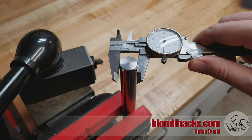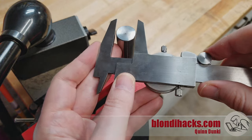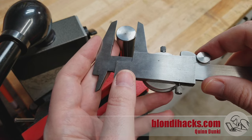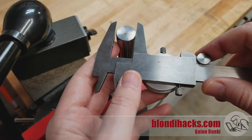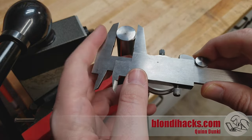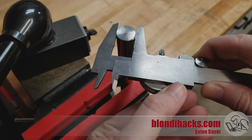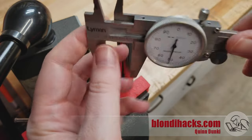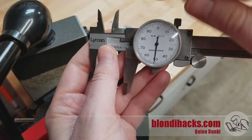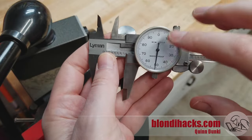That's what this little thumb wheel is really for. By using this to apply your pressure with the jaws, it applies pressure straight up through the rigid portion of the jaws and keeps you from accidentally distorting the whole area. So this thumb wheel is your friend for getting an accurate reading. In the real world, you're often taking readings in awkward setups and you might be forced to hold the tool in a position where you can't read the dial, or there might be parallax error because you're looking at the dial at a weird angle. That's where this little lock here comes in — I can apply the caliper to the work using proper technique, lock it down, remove the caliper, and there's my reading.